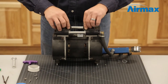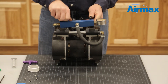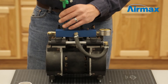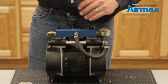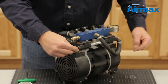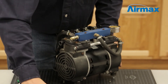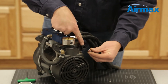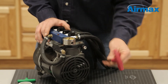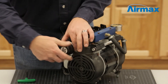Reapply the two bushings onto the two remaining holes in the head assembly. Reinstall the manifold using the two remaining screws and tighten down using a 5/32 inch allen wrench, going back and forth to ensure screws are securely in place. Reinstall the two 1/4 inch pipe plugs with a 1/4 inch allen wrench — it's important the plugs are reinstalled in their original valve plate holes. Reinstall the air filter onto the last valve plate hole using a 5/8 inch wrench.